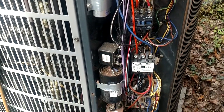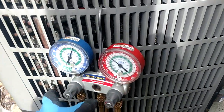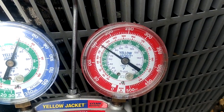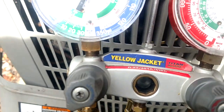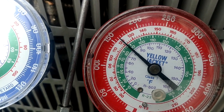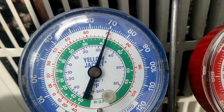The heat pump was running low in high speed, so the compressor is going to be feeling a lot better now - might even send me a Christmas card it's so happy. We've got about 84 on the discharge and we're still coming up. The pressures were looking pretty good before I disconnected. Might have to squeeze a little bit in there, but we'll let it run for a while. Suction is about 46-47, so superheat is definitely looking good.